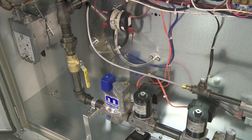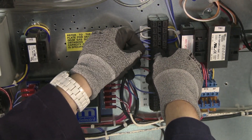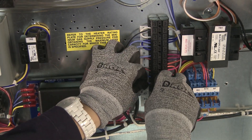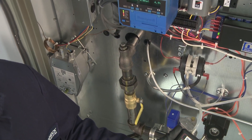Turn the burner shutoff valve to the closed position. Energize the heating by connecting terminals R to W1. Verify the unit's optional inlet air temperature setting is above the outdoor or incoming ambient air condition. The burner controller module status light will turn green to prove power, confirming the heat command, which initiates a 15-second pre-purge before progressing to pilot. When the pilot light turns yellow, the pilot solenoid will energize and allow you to verify pilot gas pressure.